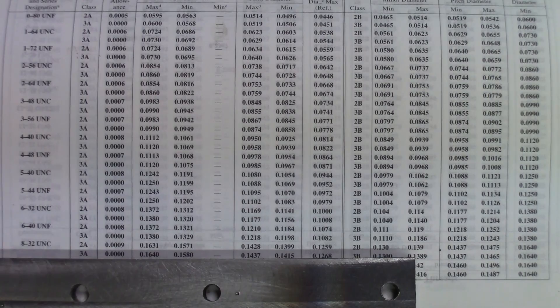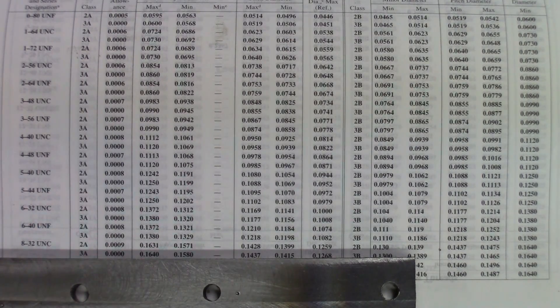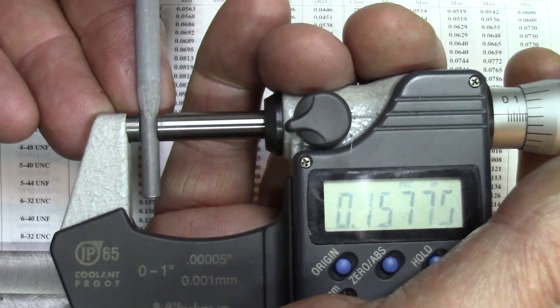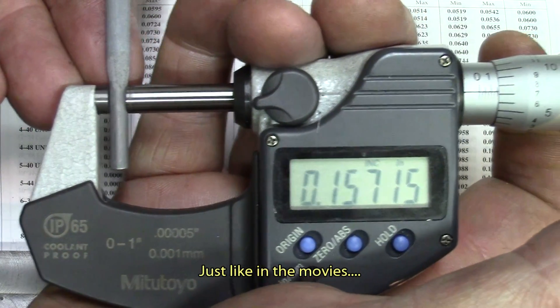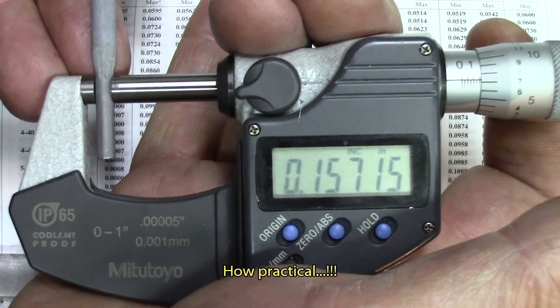Checking the Machinery's Handbook, which is the machinist's reference, you find out that the major diameter for 8-32 thread, class 2A, the maximum is 0.163 and the minimum is 0.157 — within a tenth of a thousandth. The welding rod is pretty close to what we need; we're on the lower end of the diameter requirement, but we're there. It's going to be a class two.